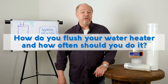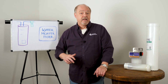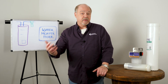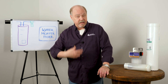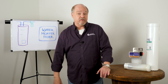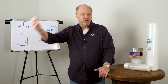How do you flush your water heater and how often do you need to do that? You really shouldn't have to do it very often if you maintain it properly — protect against sediment on your main water supply and protect it from scale with either a softener or an anti-scale product. But if you're still getting debris or some hardness accumulation, there's a drain at the bottom: turn off the incoming water supply, open that bottom drain, and let it drain out. You can usually hook a garden hose up to it and run it to a slop sink or out of the garage. How frequently really depends on how much accumulation you're getting. Periodically while draining, you might want to turn the inlet on a couple of times to stir things up so it goes out the drain.